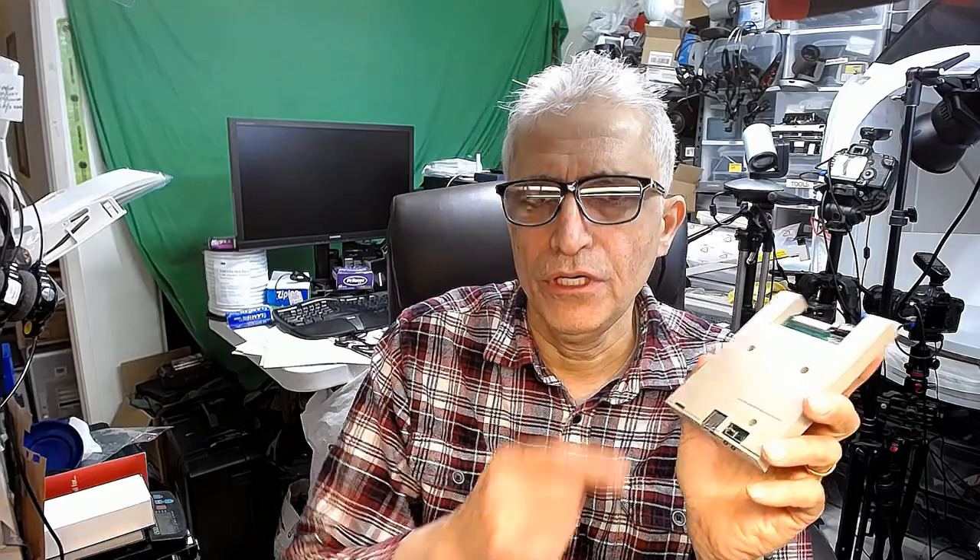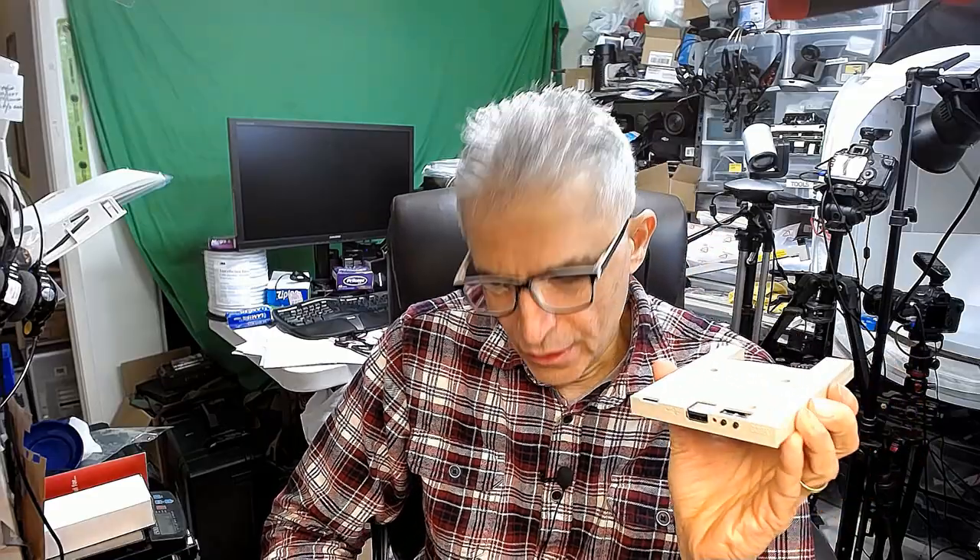When you're shopping for one of these, you need to buy the one that's advertised for your specific machine, because they are all different. They differ in the capacity of their internal memory, the pin layout on the back, the number of pins, their firmware or flash program inside. Each one is device-specific.